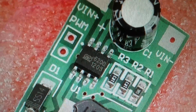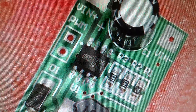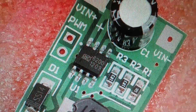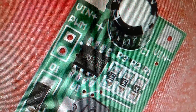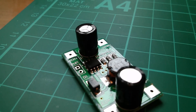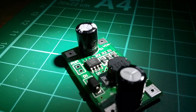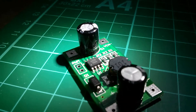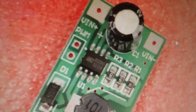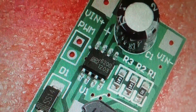The chip is a 6200 and there's a little logo on the chip. I've searched far and wide but I cannot find a datasheet for it — so if anyone can find a datasheet for a 6200 LED driver I'd be very grateful. Just to confirm, I'll shine a torch on it: there's the 6200. This one doesn't have the logo but has a different date code — 1305 versus 1203 on the eBay listing. So 6200 is definitely the part number.